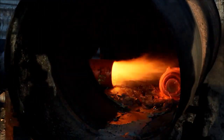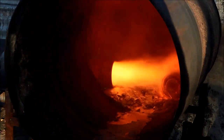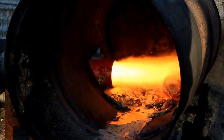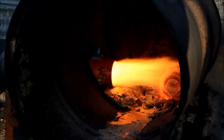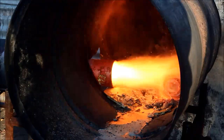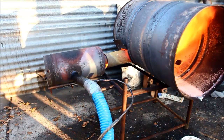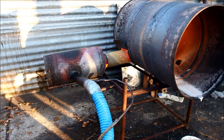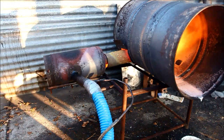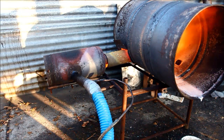From the other side you can see that 4 inch thick wall pipe is well and truly glowing red, even though I've just got the thing on idle. It does pulse a little bit because I haven't got a very high fuel level, and I've probably taken maybe 2 litres of oil to melt that aluminium. Even though this isn't insulated it's extremely effective. The next thing I'll be trying with this is melting a full engine — I don't think it's really going to take a lot of effort. My big burner in the horizontal position is quite happy. I started it off with a bit of rags and sticks for a preheat, gave it the air and it just fired right up. It's probably got more hot surface area to work on in the horizontal position than in the vertical, so it doesn't mind running that way.